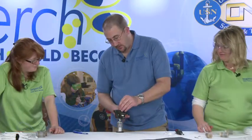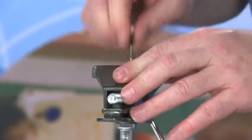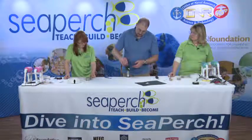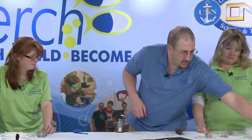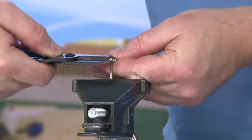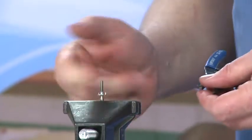We're going to put the rod end into our vise. Some vices have a nice groove to hold a round shape — those work best for this. Once it's firmly in the vise, take the T-nut and put it on with the spiky parts facing your fingers. Do your best not to stick yourself. They'll be a little tight going on, so you may need to grab a pair of pliers and work them to get the first few threads going. Once you've broken through the threads, they'll spin right down.